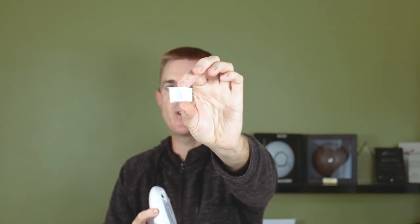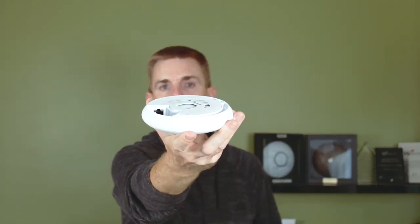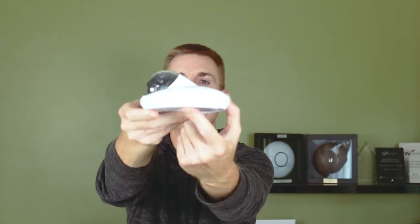This is the protective lug that we'll take out — if we just take this out, you can actually see the hole there that you'd pass the cable through. It's got more of an RJ45-sized opening on this side, so you pass the cable through and connect there. You can also see the Ethernet connector, and round the top there's a channel which comes to a lug at the end that can be popped out, so the cable can come out directly from the side. If you were mounting this on a wall flush and couldn't run the cable through, you'd be able to bring the cable in from the side. Once the cable is passed through, you put the lug back in place, which will keep bugs and some level of moisture out.